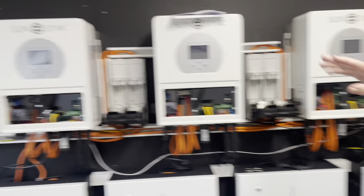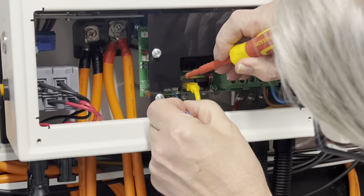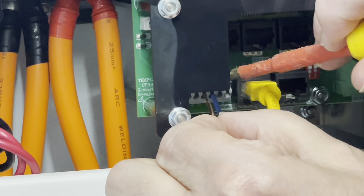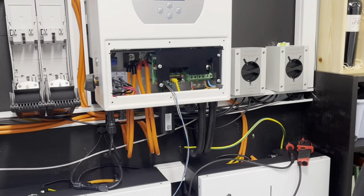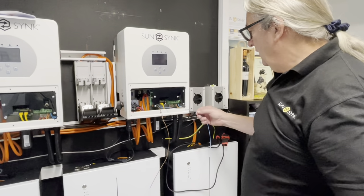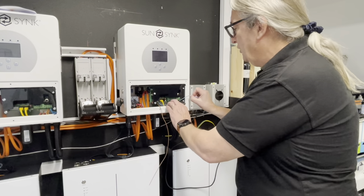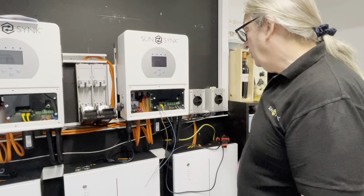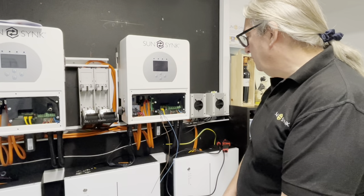Let me pre-wire it. Batteries off, solar off, AC off — as is the three inverters on the demonstration site. Connect number six here. This is purely for demonstration. This is my supply, and one of the things I need to consider is there should really be a little inline fuse on here for protection, because I'm going to use an external relay. Otherwise I'm taking straight off a higher current onto a smaller cable, which is not good practice. There should be a small inline fuse.